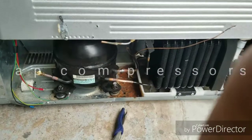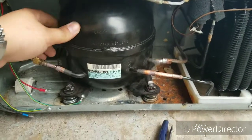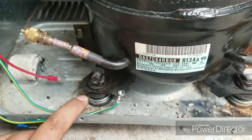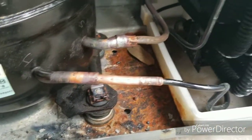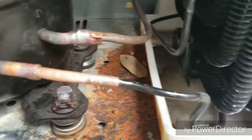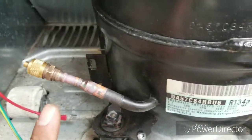Right now we are retrofitting the compressor. I cut out the old compressor and retrofitted this new one in place. I had to undo the posts for the old compressor because they were a different port style, and I welded the new posts about an inch or less — about three-quarters — so it would fit this compressor. The suction line is the low side over there, and this is the high side. I'm also retrofitting with some old copper tubing I had.